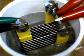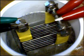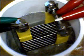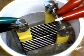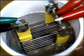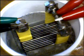Anyway, the other thing that I had observed with my tall zero cell in the car, and I was a little concerned about it, was when I energized the cell, what I observed was a great amount of production from the center negative plate and less from the intermediate neutral plates, and a little bit more from the positive plates, but not as much as the negative. I had settled on just under 2 volts per plate cavity. So for every plate, there's 2 volts dropped in between, with 13.8 volts going in and 7 cavities altogether, divided among the 13.8 volts.